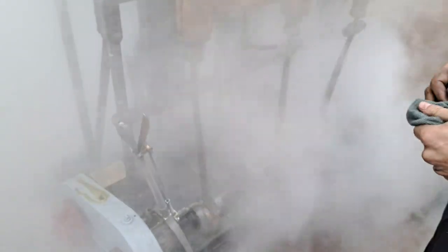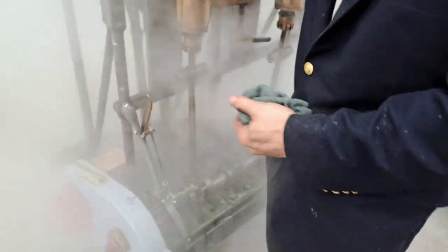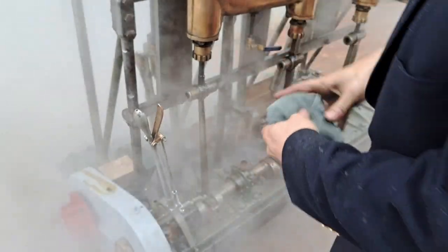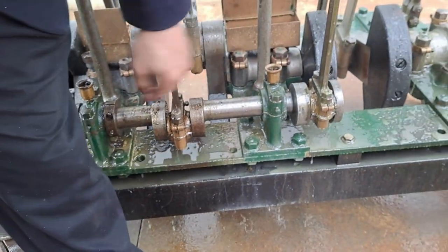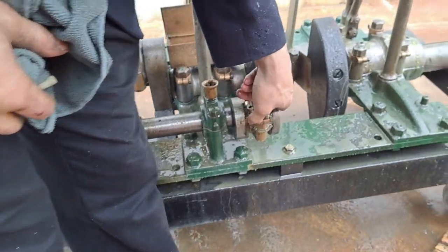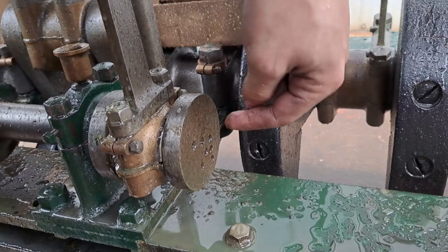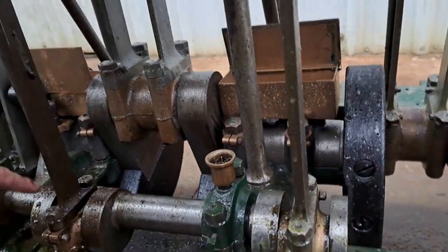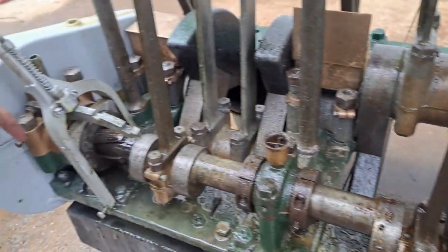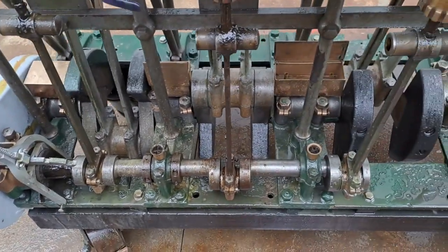There's another thing about this engine to appreciate craftsmanship-wise. This beautiful valve shaft is one piece — except for these thrust collars. Look at this end plate — you see all the different centers? When you put this on a lathe between centers, you have to put it in every single one of these to turn that pin, that pin, that pin, and things on the phase variator. So he afforded you a lot of things to work with on this.